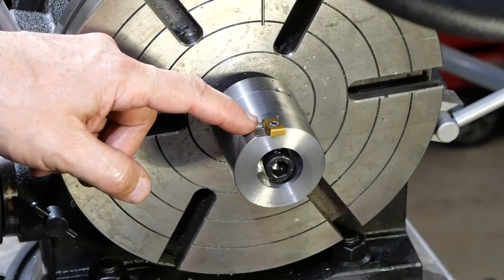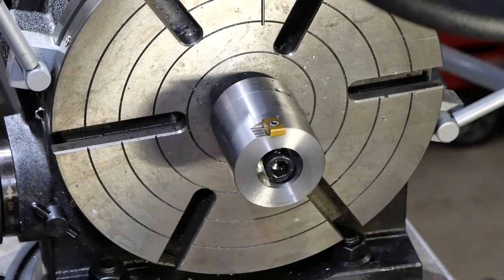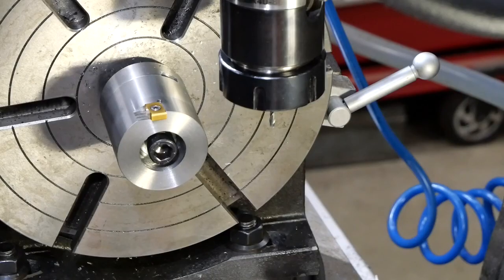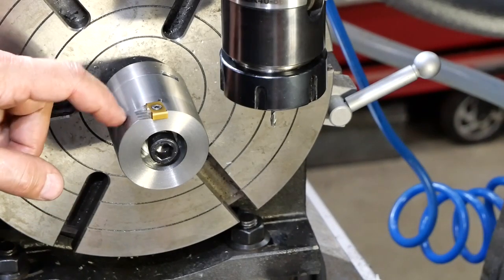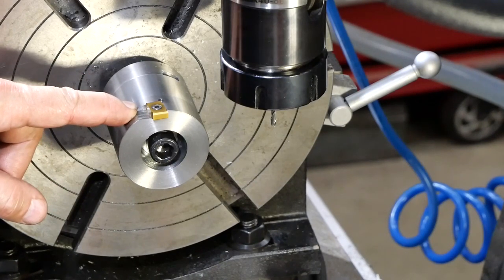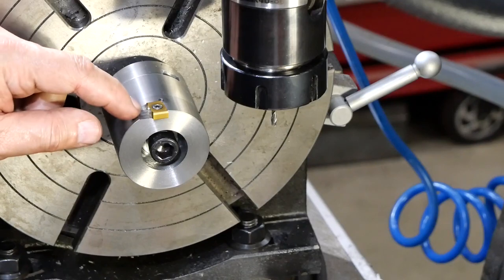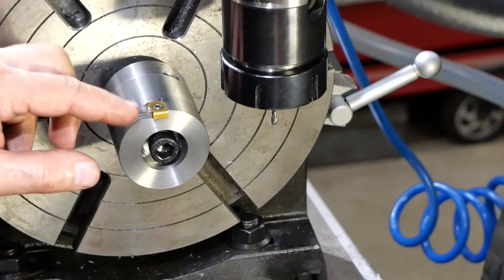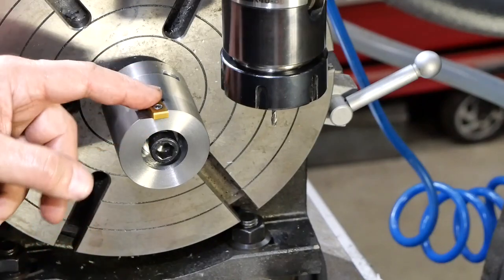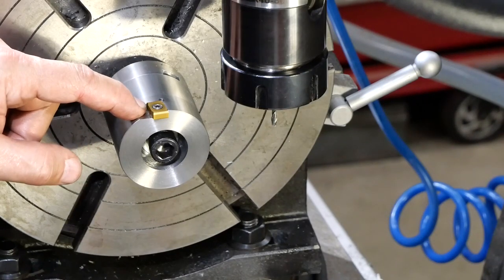And the last thing in the world I want to do is create a scenario where this doesn't go all the way. In fact, that's what's happened here. Looking at it more closely, it hasn't gone all the way down. Why is that? Well, it'll be hard for you to see, but I actually just ran the cutter around again, just on 1.75 setting. And it obviously was just enough that this piece is now fitting properly and is sitting down in the pocket. I suspect there was a little tiny ridge just around in the bottom corner. That just highlights how difficult this is going to be to get all of these things riding at the same height. Anyway, that one now is good, and I'm going to come back to focusing on this 2mm pin, 2mm hole for the dowel pin.